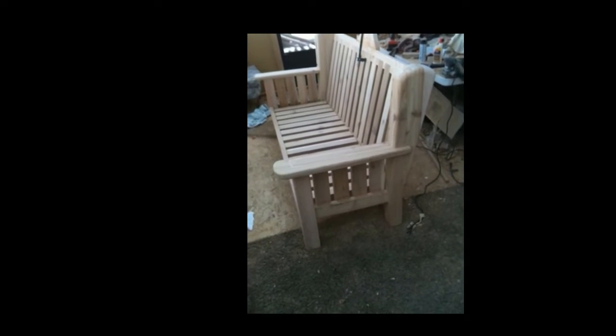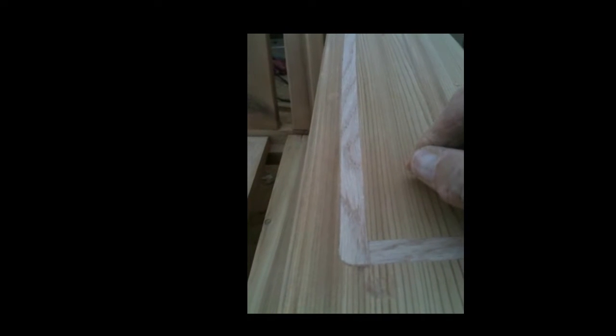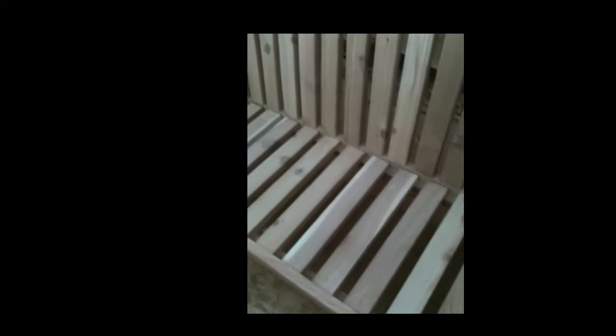We're just about finished with the woodwork now. Last time I was showing you the screw holes in here — I tried to cover them up with an inlay, and I've done that. It's a piece of oak that I bought — I cut a groove here with a router, then cut the oak with a table saw, and shaved it down on one side so it would fit. I made a mistake on the first side and you can see this little extra piece I put in. The other side, after I'd had a little experience, I didn't make any mistakes on, and you can see that one's done a bit better. But it's a lot better than some nails sticking up.